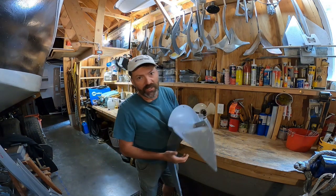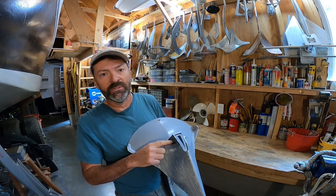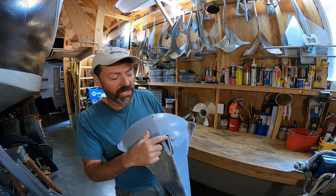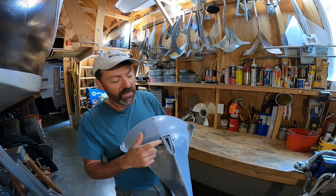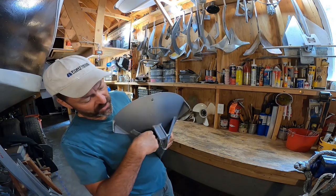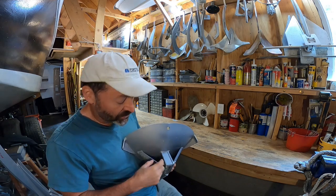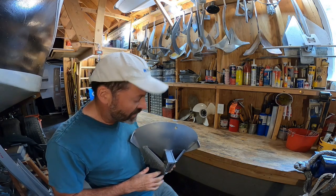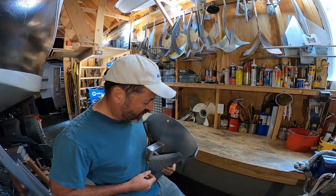I'll give a few more looks at some construction details. Spade anchor shanks are removable, held in place by a single locating bolt — it's non-load bearing; the shank slips through a nicely fitting socket. Looking at the very bottom of the shank, you can see it is hollow, made out of three pieces of metal — one side, a second side, and a small piece in the middle — a welded structure. The lead is exposed to salt water, just poured into these cavities. If you look inside, it appears they either poured heavy paint or epoxy on top of the lead in an effort to seal it from the salt water. Let's assume it is sealed out of the box, but I just cannot imagine that treatment will be permanent.